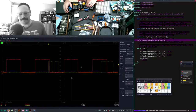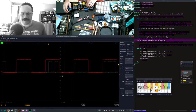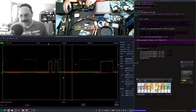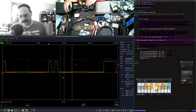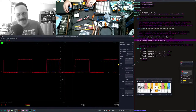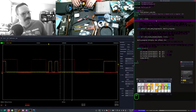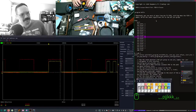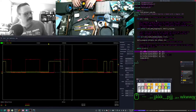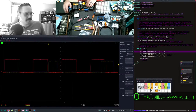We're just doing some... Raspberry Pi has a Pico device. The Pico device actually has some programmable I/O. And it has, like, a tiny little state machine inside. And you can use it for handling external clocks and things. It's kind of overkill, but it's really kind of interesting to me. So I'm messing around with it and having trouble with the timing and figuring out how to make it send bits. Bits and bytes, actually. Hence this 16 out pin commands. So...